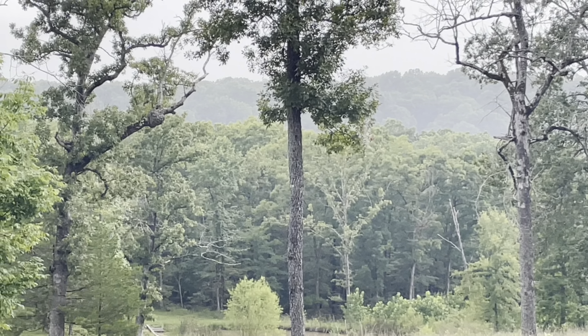Well, everybody, we're back out here on another day. It's been a couple days since we were working last, and the rain has stopped. The heat's come back. It's plenty warm out here. It's kind of after work, so I'm working kind of in the evening a little bit. And the next step I'm doing is I'm laying out all the base plates so that I know how many studs I need and determine where the windows are and the doors and everything. So I'll kind of show you how I'm doing that next.